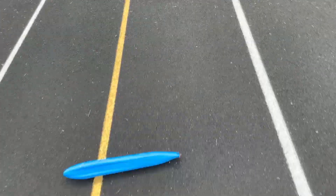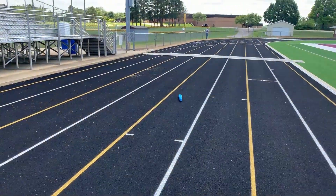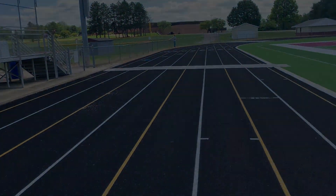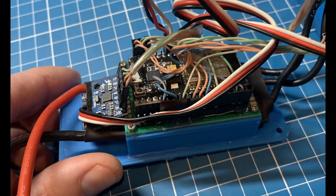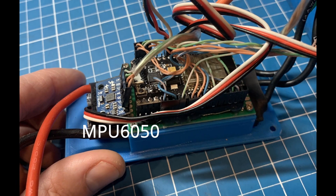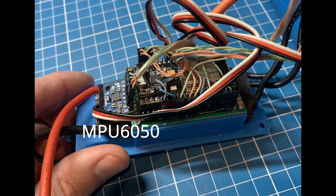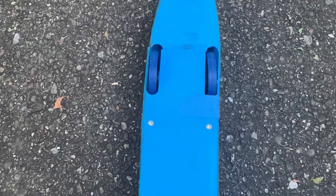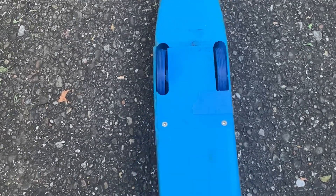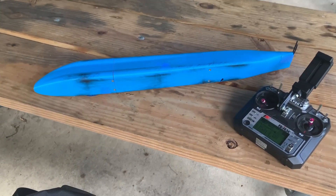The maiden test of Version 2 was honestly a complete failure. As you can see in the clips, I can't even drive the car 50 feet without rolling it over. I fought with it for about an hour, then gave up due to a rear tire failure. After the test, I noticed that the MPU-6050 — the inertial measurement unit I'm using, which is responsible for the car's stability control — was actually mounted in a different orientation from the Version 1 chassis. So the stability software was actually destabilizing the car rather than stabilizing it. I went ahead and fixed the code, then found a location for test run number two.